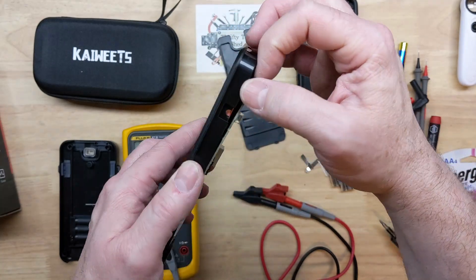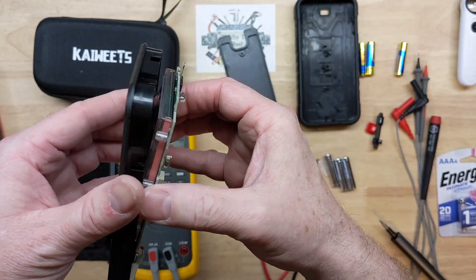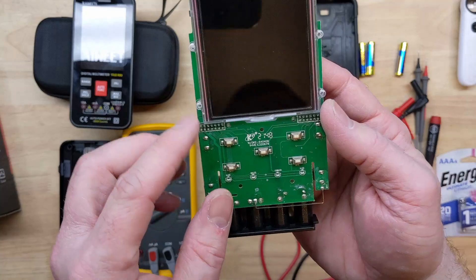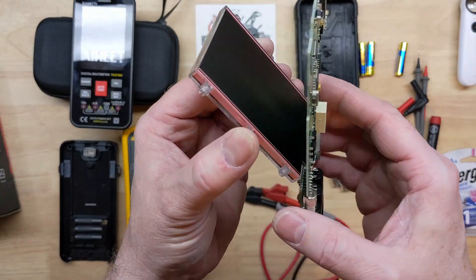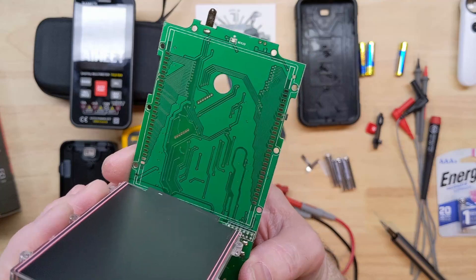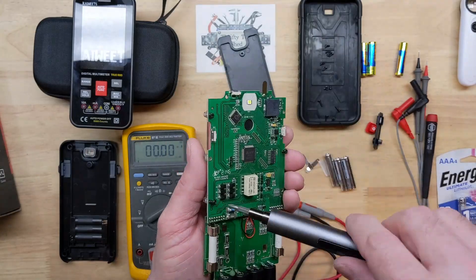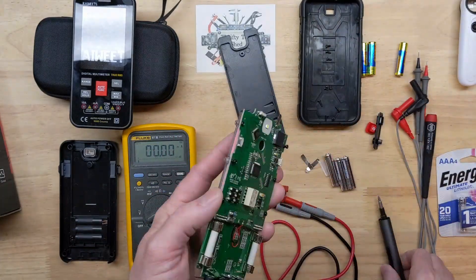It's easing out — we can see the elastomeric strips. There's the LCD. We pull our jacks out, which are also on a plate, and there we go — completely out, even the LCD. With the six screws loose you can see the backlight connection and where the zebra strips or elastomeric strips meet up on the board. I'm putting those six screws back in to keep those connections clean.